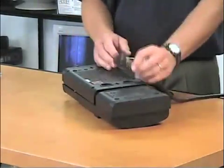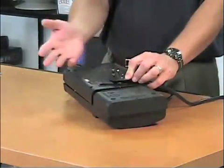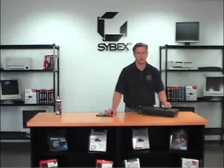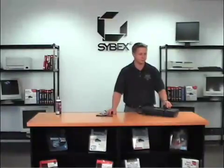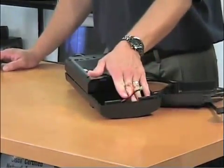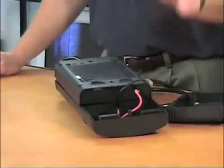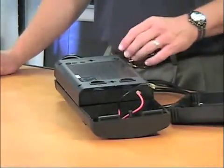You'll find that on the outlet, you've got your typical basic 3-pronged outlet, 2 prongs for the AC, 1 for the ground. Just like everything else, it should plug into an isolated ground if possible. Isolated ground outlets are always recognizable by being orange. So you want to plug it into there. That's where it will dump the surge to. If we pull it apart, however, what you'll find is there will be a 12-volt battery in here. This 12-volt battery has only 2 wires, not 3. You've got your positive and you've got your negative there. The third wire is for the ground. It doesn't matter to the battery. The battery doesn't have a ground anyway.